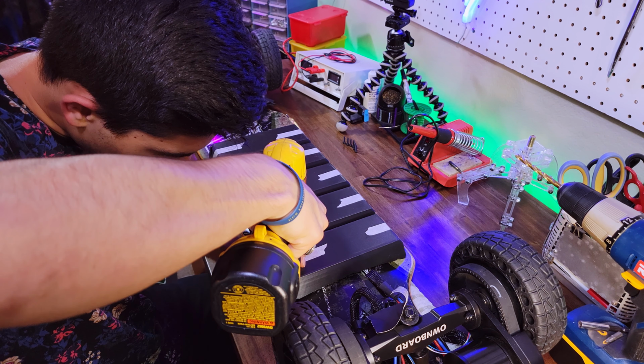Now you have this little assembly, and you're going to take this and stick it right into the drill. So you should be able to get the flat face of the nut to attach to your tri-finger chuck, and you know you did it right if it doesn't wobble too much. It looks like mine wobbles a little bit, so I'll just loosen it and straighten it out. There we go. See, it runs true with the drill.